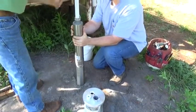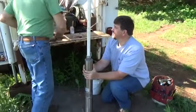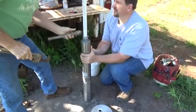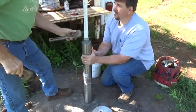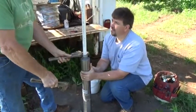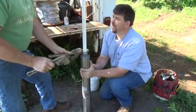Do you ever have to put a low water sensor in on a well? I have, but with all the cables and everything going down it became a real pain. So what I do now is just size the pump smaller, or put a water flow restrictor on top at the discharge. They come in one-gallon, two-gallon, three-gallon, and five-gallon-a-minute sizes, so no matter what the pump is rated for, it only puts out three or four gallons — matching the recovery rate.